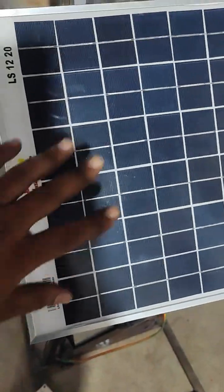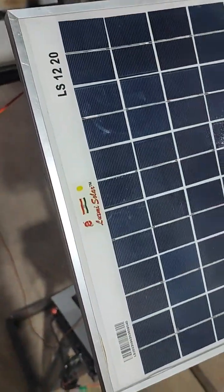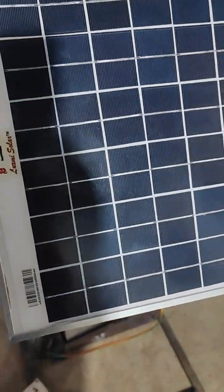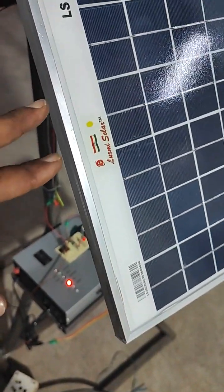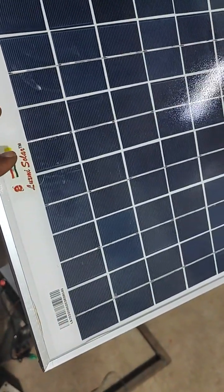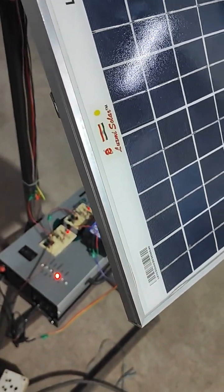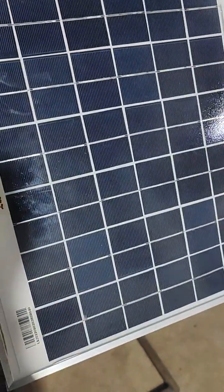The emitted voltage will be stored in the battery. These photovoltaic diodes come in different types such as monocrystal, polycrystal, thin-film crystal solar cells, high concentrator solar cells, and concentrator types — there are many varieties. Here we are going to use a polycrystal solar cell. These solar cells are connected in series and parallel format and give an output voltage of around 12 volts at 20 watts.